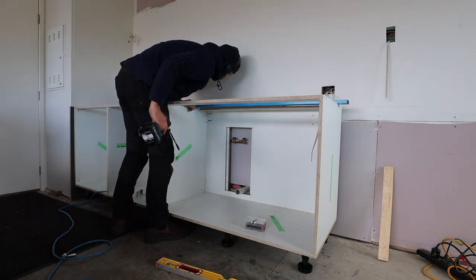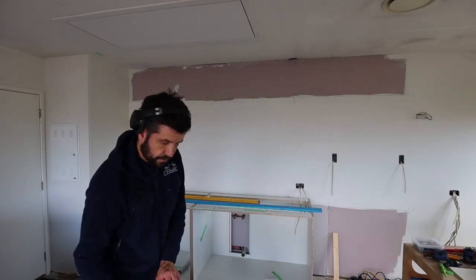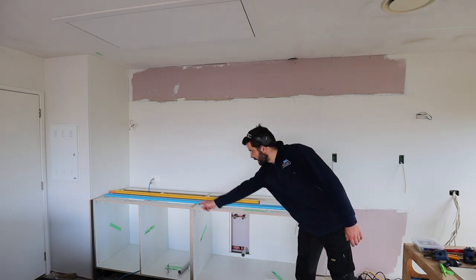I must have got this wall straight because both of those blocks were the exact same thickness. You've got to give yourself pats on the back when you're doing stuff you don't know how to do. Now before I jump up and do those top cabinets, I've got to strengthen this up here — because there's no middle partition on this cabinet, and like I said earlier, that's because of the sink. The sink's going to go there and I need all the space, so I'm going to do something else to beef it up.